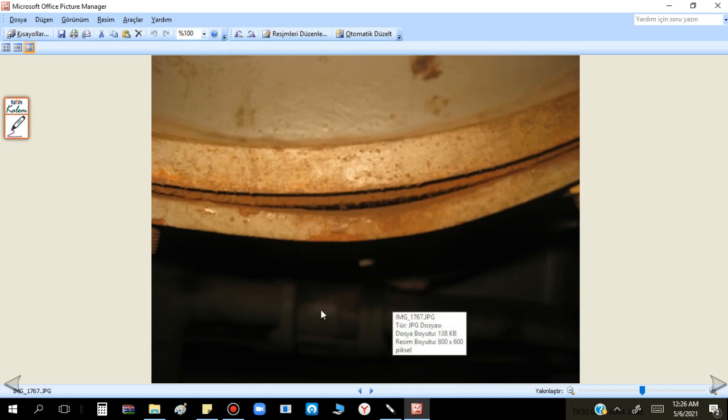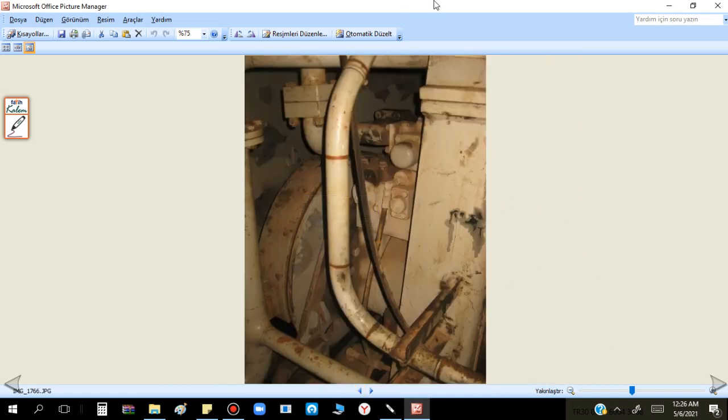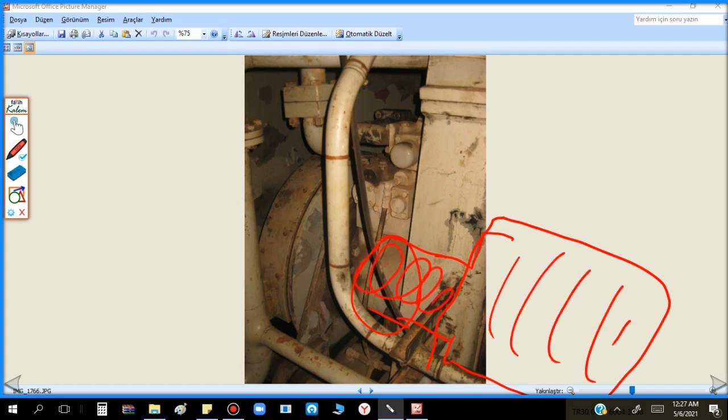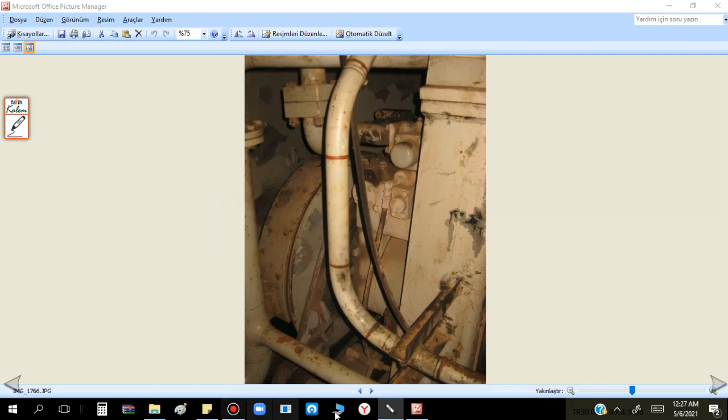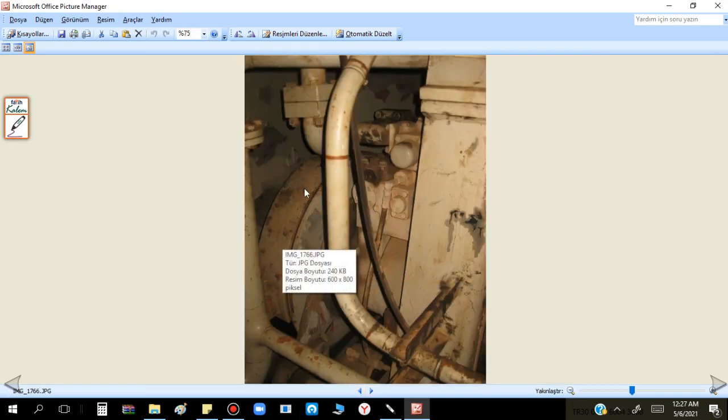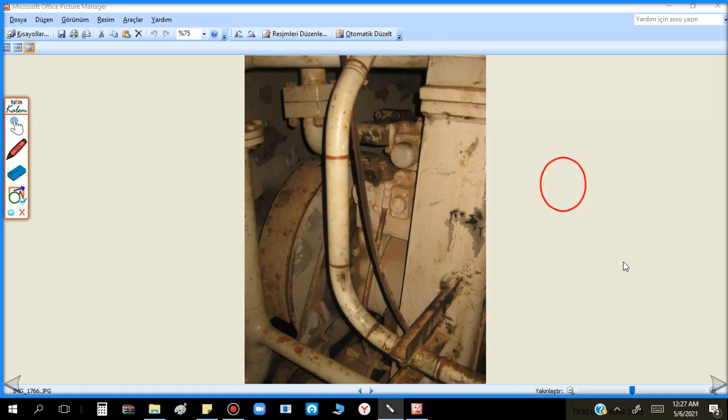I draw here - this is the shaft coming here, the hydraulic part, and then my hoisting drum in there. The hydraulic part turns the drum. This is the brake mechanism - exactly the same as the windlass. So when you check, you see there is some deformation on this part. Maybe I take the photo from the down part because the disk is inside here like this.